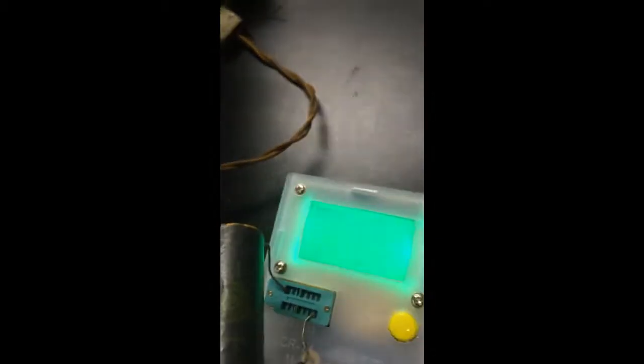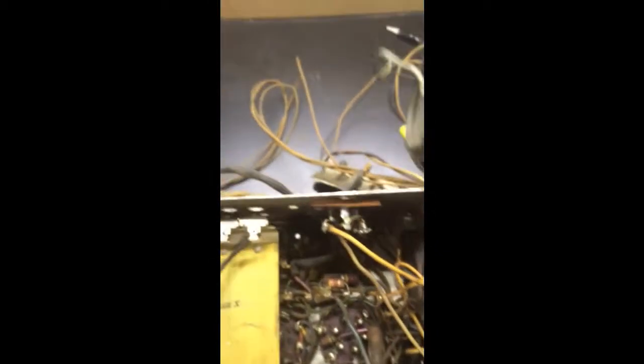Here's one I actually pulled out — this is the 12 microfarad cap. Here's the old one, massive thing. Using this cheap little ESR meter, about $15 on eBay. The cap is rated at 12 microfarads — remember that number. Snap it in and it reads 26.73 microfarads, with a 2% voltage loss and an ESR of 1.3 ohms. It's labeled 450 volt, 12 microfarads.